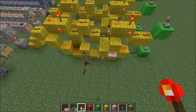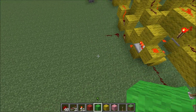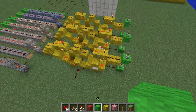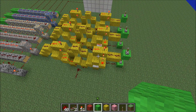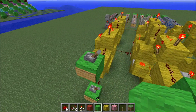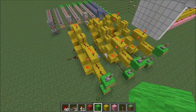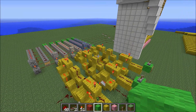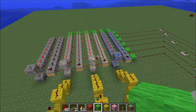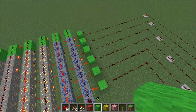I'm going to show you how to do it and show you every gate you need. It's just two half adders — each half adder is made out of three gates, so it's not very complicated. It can get big unless you squash things together, but this is a bit hard to look at. You can get these designs off the wiki. The outputs go into a decoder and then an encoder for this seven-segment display.